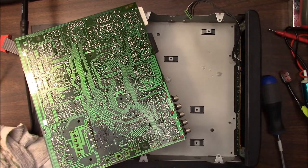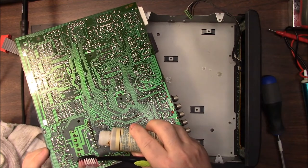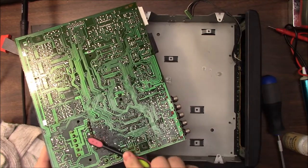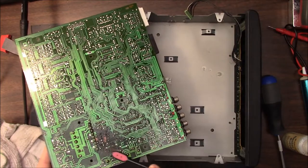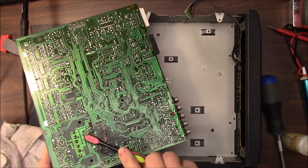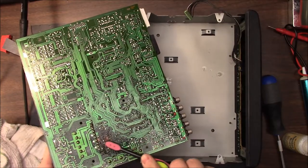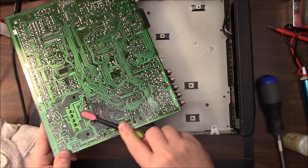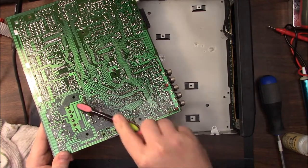I'll put a little bit of alcohol on it to dry out and neutralize whatever liquid is there — I can see it's eating up the traces. Let's take some alcohol and rub it down in there and make sure we clean all that up. I'd say this capacitor right there went bad. Yes — we'll check all the traces to make sure they're in good shape, but that's pretty bad. That's what happens with some of these old capacitors.